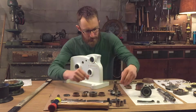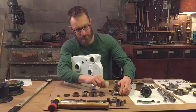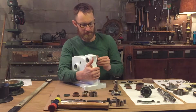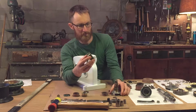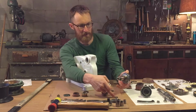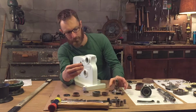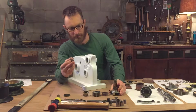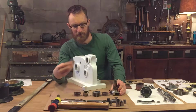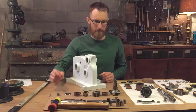And so here's what goes in. We've got the spindle, an O-ring goes into the spindle, these bushes going into the case. This is the main part. There's a key that holds it on the axle, a bush on the other side that holds the other O-ring, another bush for the case, and then a washer and a bolt to hold it all together.